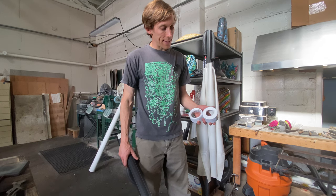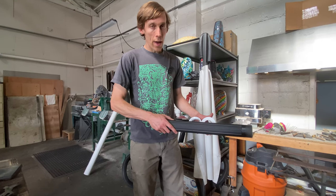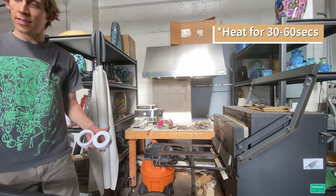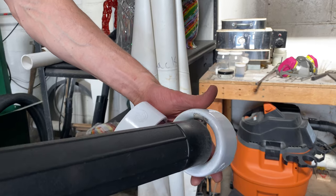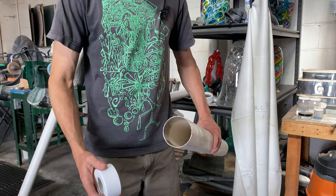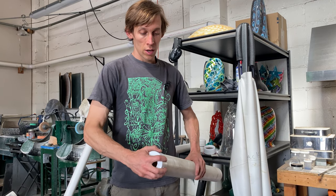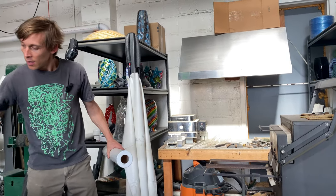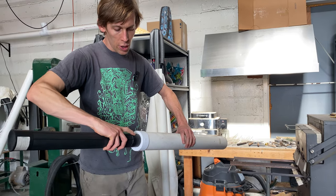In order to get this hole to look like this one I'm going to heat it up in one of my ovens here to about 700 degrees. It'll only take a few seconds and then when I pull it out it'll be nice and soft and I can shove this shop vac piece into there and it'll be a perfect fit. You're going to need a short section of your three-inch PVC pipe to put the cap onto so you can put it into your kiln and have something to hold it with before you plunge this into it. And you don't want to go too far — just about halfway.